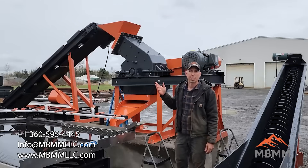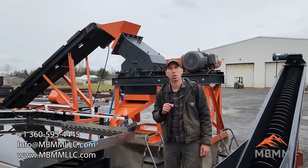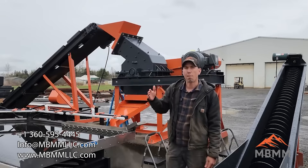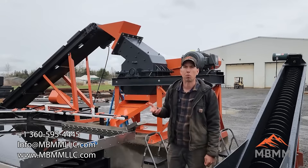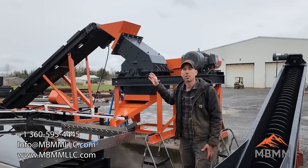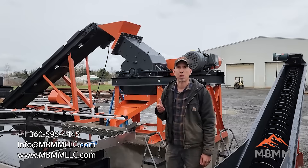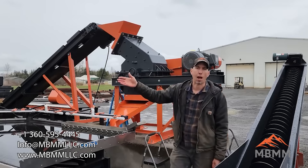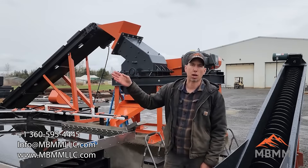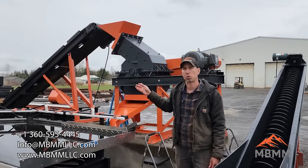This is our 24 by 16 hammer mill, rated at 2 tons per hour with our smallest slotted screen, which is a 0.8 millimeter laser cut slot. With a larger screen such as 1.2 millimeter you can get faster throughput through the hammer mill. The maximum feed size is two inches, but we recommend one inch and smaller for faster throughput and to reduce wear, since the jaw crusher can do a lot more work faster than the hammer mill can. Having the jaw crusher reduce it to one inch minus and then feed into the hammer mill reduces wear on the hammer mill and also increases throughput.